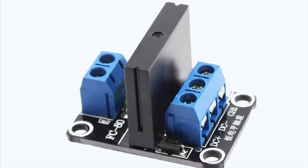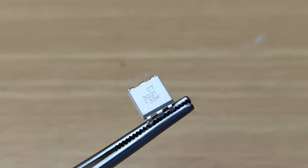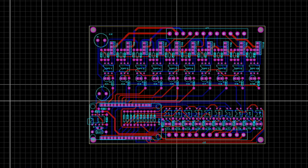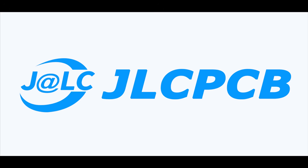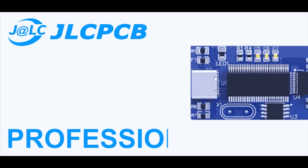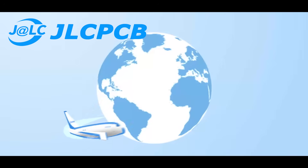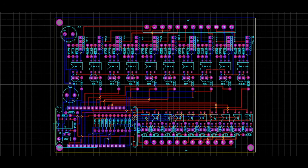To keep things low cost and DIY friendly, I'm not using off-the-shelf SSR modules. Instead, I have designed custom solid state relays using triacs and optocouplers, which are two core components of any SSR. To make the build more professional and error-free, I designed a PCB for this project — it helps reduce wiring mess and makes everything plug and play. This video is sponsored by JLCPCB, one of the largest and most reliable PCB manufacturers. Whether you are a maker or a professional, they offer high quality PCB fabrication, SMT assembly, and super fast delivery at an affordable price.